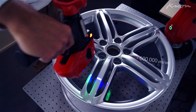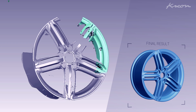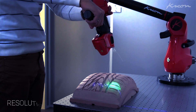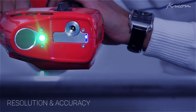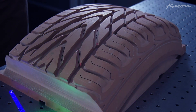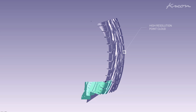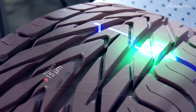This is a completely new scanning experience. The Skyline 3D Scanner can scan complex parts thanks to a high definition camera and a 2,000-point laser line. It produces high resolution point clouds quickly and acquires the finest details. Due to its 15 micrometer accuracy, it handles the most challenging measuring requirements.